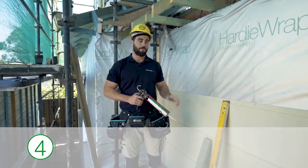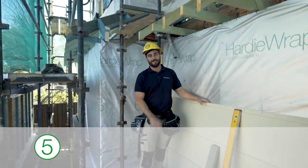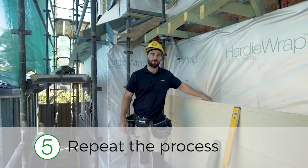So step 4, fill your internal corners with the James Hardie joint sealant to fill up that 2mm gap. Step 5, repeat the process, just fix off all the remaining boards until you have a professional finish.